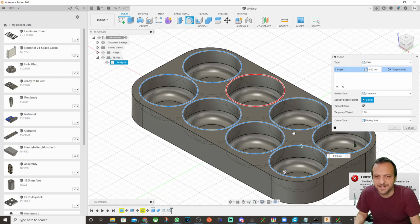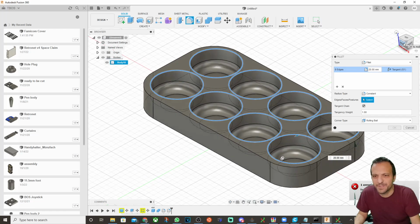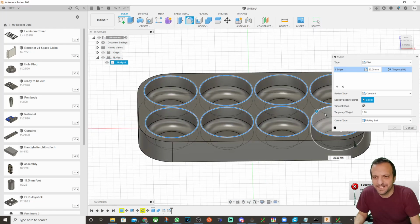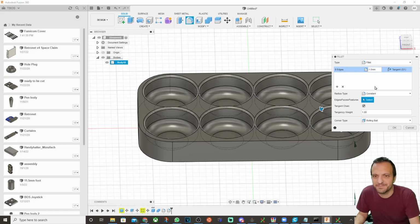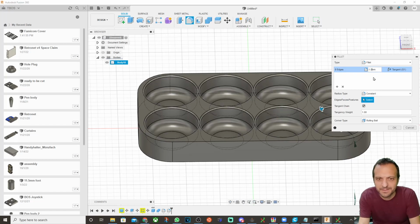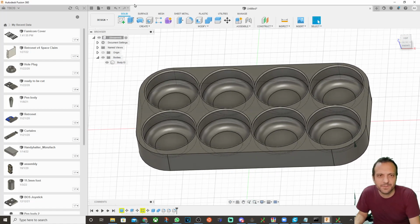Oh. I'm getting all sorts of errors here because of the way it's applied. It's not able to quite apply it in a sensible way. Bad edge blend geometry. Okay, let's do it here. So we're at 22mm. Let's just manually do it, 3mm. Look at that. That looks sick, doesn't it? 1.5. Yeah, there you go. That's more like it. 1mm. Well, I think that's right. So that's basically what we want on that. So it's not so harsh.